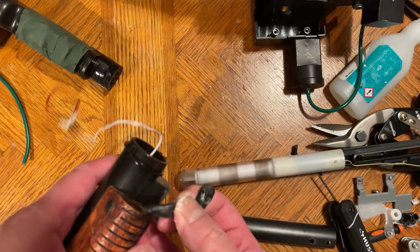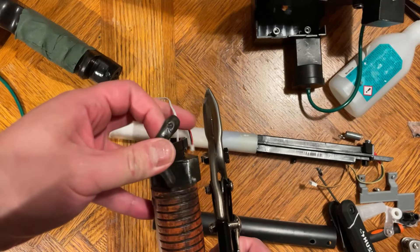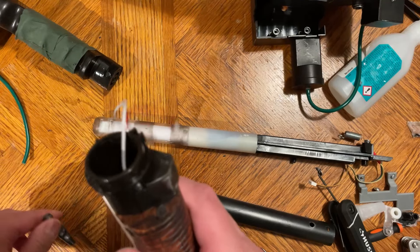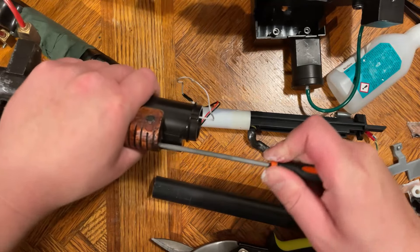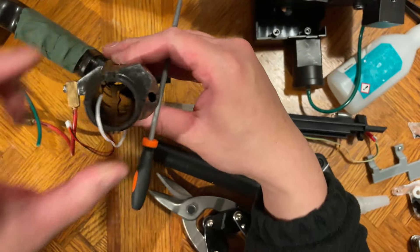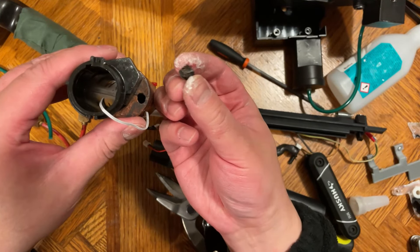This just broke on its own but I think I can still demonstrate. So it came out like this — this piece was connected like that. You see this little nub here: all you really have to do is clip it off, stretch this up and clip it off underneath, or just cut anywhere along this wire piece right there. Then this piece comes right out. For this piece it'll be easier if you remove everything including the LED — if you have the stock one the piece is just glued on and you can just rip it off.